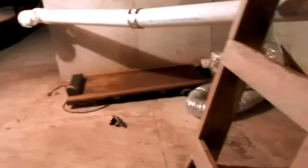Here's where the meter was — I took it out and put it up there. This is the lowest part of the house. I open that up and there's a little bit of water coming out, not much. We'll leave that open so if there is any residue — shouldn't be, I blew it all out with air. I can't stress enough guys — you need to really take your time and go around. If you're gonna do this procedure, do it three, four times. Go around after everything's done and make sure there's no more water in the system. This house has no heat all winter, so I'm gonna save them a ton of money on the electric bill.